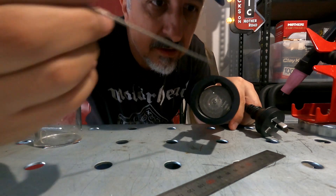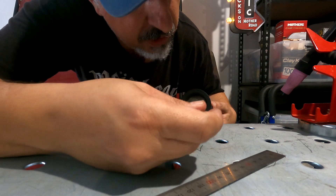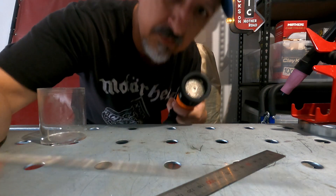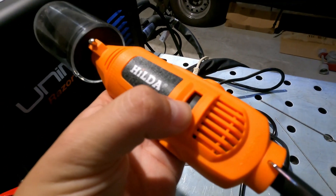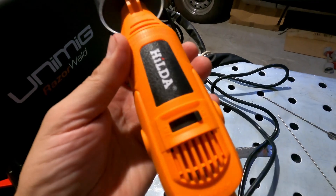It is also worth noting that you can cut your tungsten off. If you were to dip this, there's a cut-out which allows you to just put it in that gap there, just push against it and it'll cut your tungsten off so you can grind it fresh again. This also does have a speed control — looks like it's got maybe six or seven notches that you can adjust the speed.